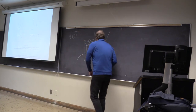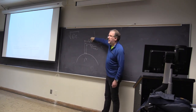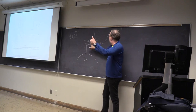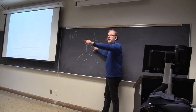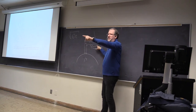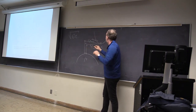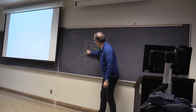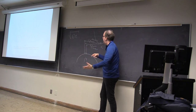So here the carrier, the electron, would come to here by either absorbing a phonon, so by absorbing a phonon its energy went up a small amount, right? Or it releases a phonon, releases heat. What's your name? Connor. So as Connor said, this is releasing a phonon, so therefore it dropped in energy a small amount. And so then it's coming from this lower state. Now, this is not really a radiative emission. This is not likely to release a photon.